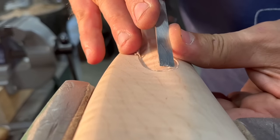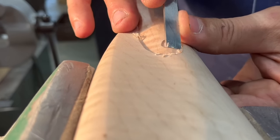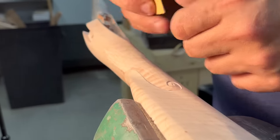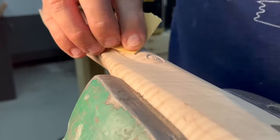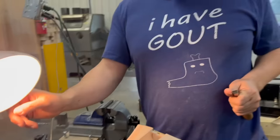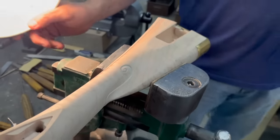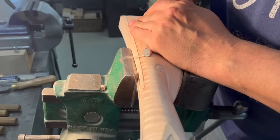Okay, we're looking pretty good. Let's get in here and scrape this a little bit. We'll sand it a little bit first just to smooth it up, knock off a few of those high spots, then get in here with the scraper. So we lost power with the phone and I kept going a little bit. I did a little bit more on this lower butt molding — you can see how it's starting to be relieved. It cut pretty slick and smooth. We'll finish that up and then this guy will be ready for stain.